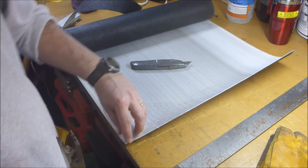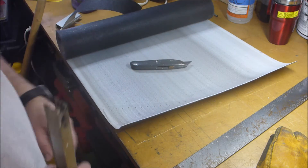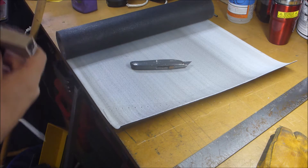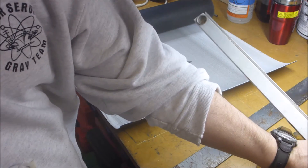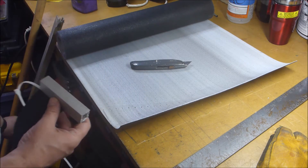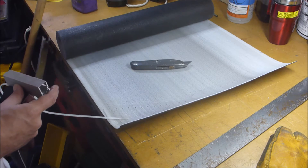I want to create a rigid bar of some kind that I can attach somehow to the Bridgeport and that will hold it. I had this scrap extrusion — this is from a screen door. You can see the little finger knob there. What looks like this is going to work out okay — I was going to take this ridge off and then slit it and stuff the material down inside, clamp it together with a screw.